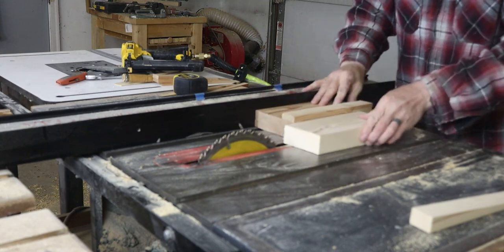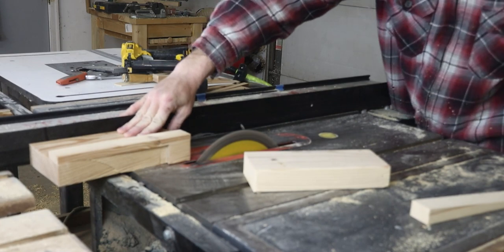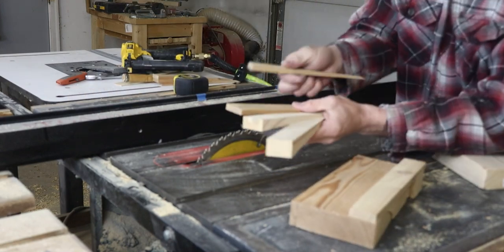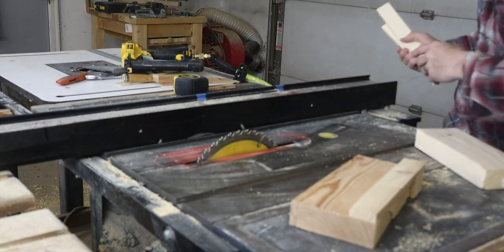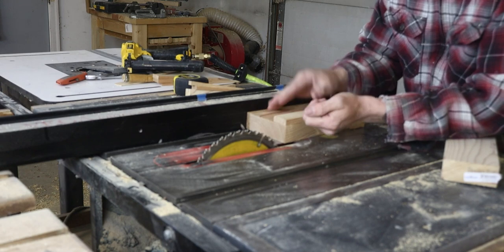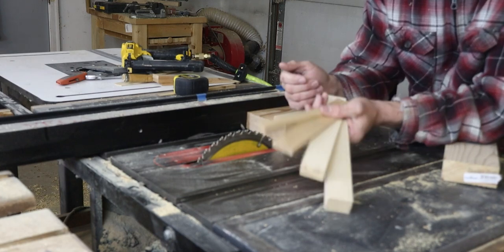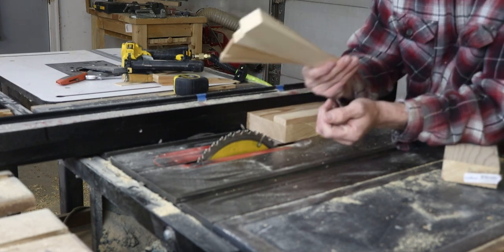Let's go ahead and cut one that's a little bit thinner. Just by cutting your board at different angles and using different shims on the back, you can create all kinds of shims with the same jig. These things are incredibly useful — I highly suggest anybody who has a table saw needs to make one of these jigs, even if you're planning on buying your own shims. It's very nice to be able to make all these different kinds, use them all over the shop, and if you have a bunch on hand you find a bunch more uses for them.